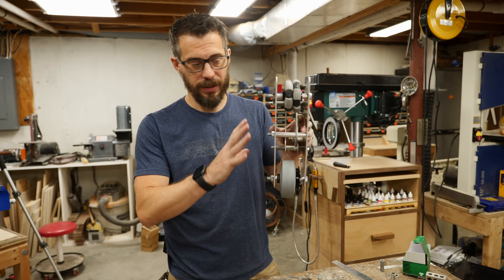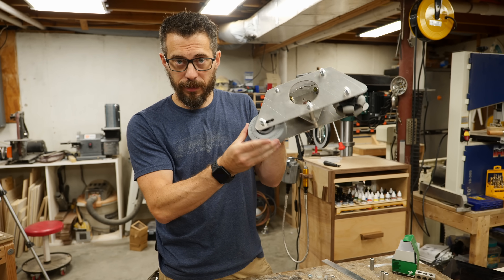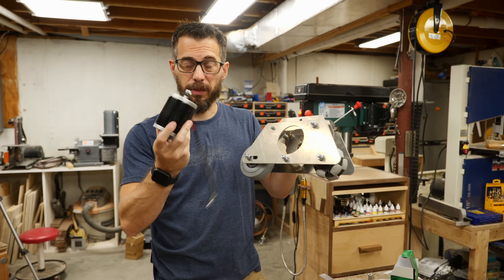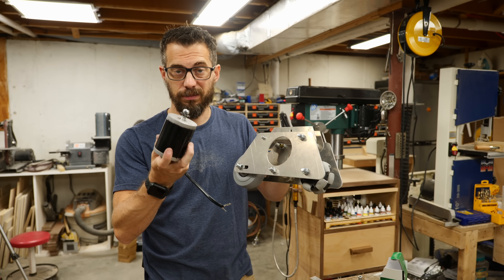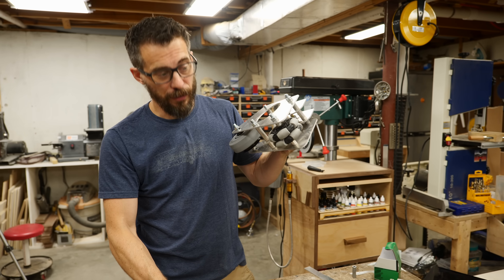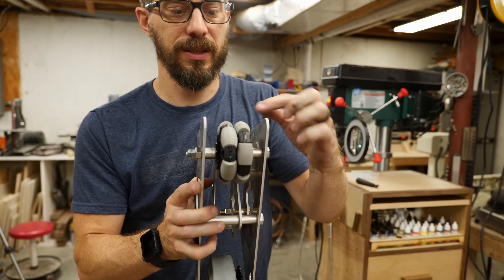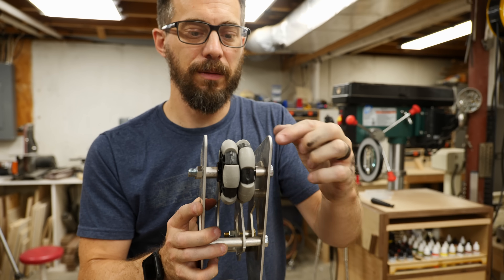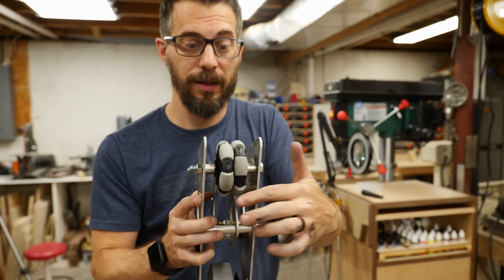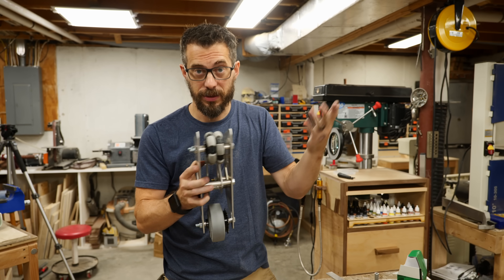I've got the basic parts of this put together. I just wanted to walk you through what's here, in case you're curious. You have a drive wheel on the back that has a sprocket — that's going to be chain-driven to a motor that's going to go in here. This is a replacement scooter motor; it's nothing really powerful or special. It goes in there and mounts, and it will drive this back wheel. The front wheel is actually really interesting — this is called an omni-wheel, and it's often used in different robotics projects. It rolls this way on the bearing, and then each one of these gray things is a separate wheel that rolls perpendicular to the main bearing. So this thing can sit on a table and kind of move in every direction, which is why it's called an omni-wheel.